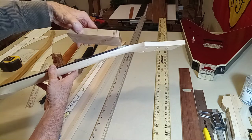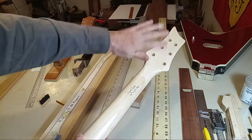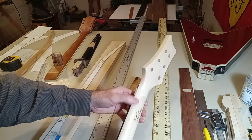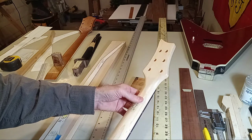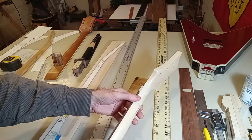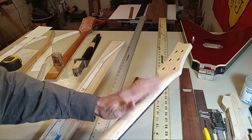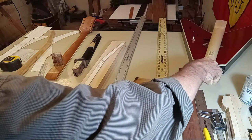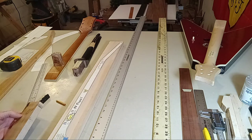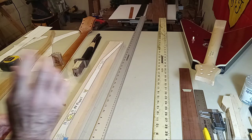So if I wanted to do a scarf joint, and I can assure you these are just as strong as if that was a solid piece of wood. It's very frowned upon. A lot of people think it's cheap, but that's exceptional woodwork right there. And it's industry standard in the marine industry, boat building, that it's just as strong. They go to like a 12 to 1 ratio. This would not be nearly that much, but it's a very strong joint. So I hope I didn't ramble about that, and I hope I didn't go off the rails and get confusing. But in other words, scarf joints are fine as long as you have the right type of glue, and you have to be able to clamp. You have to really know how to clamp that.